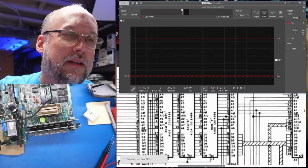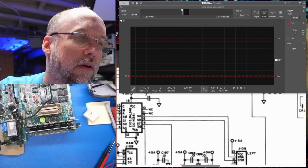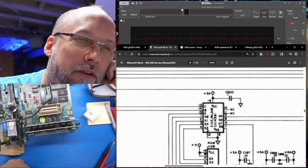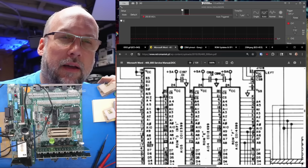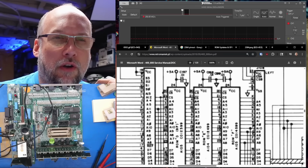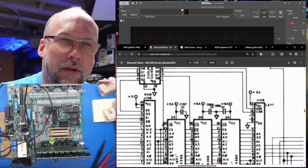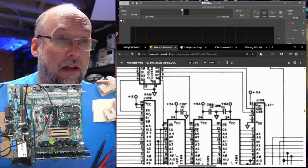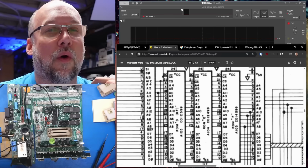Now I'm talking about, we go back to the main schematic and we zoom in and look for the chip select lines. There they are, CS. These are coming from this IC, which, gosh, that's hard to read. I think this is an LS42. Some of those lines are going over to whatever this card slot is, and the other ones are going to that card slot. It says RAM on that one. So there's enough chip select lines for 48K of RAM, even though this system only has one slot, so it can only accept one of those.